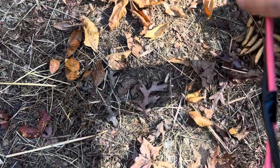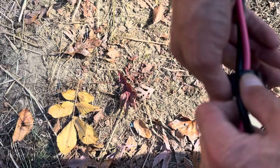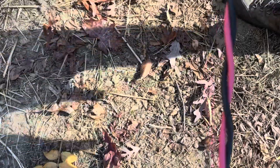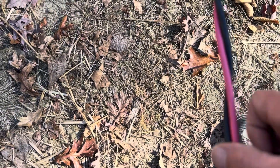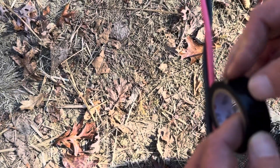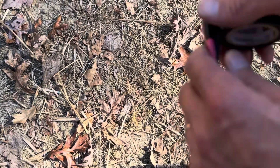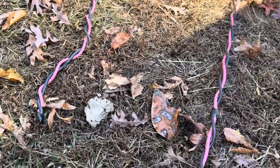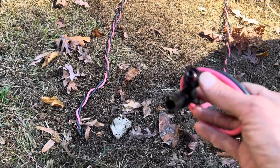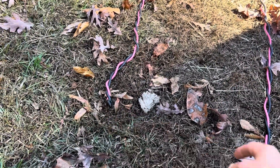That won't come unraveled or untwist any further. That will help you move the wire, run the wire, and keep them from getting snagged on stuff. You can use zip ties, electrical tape, or flex loom — you're just holding it together to make it easier on yourself when routing your wires. You've got about 50 more feet of this to do, but you get the idea — just tape it up and that'll keep it all held together. It's all twisted and taped up now. I've got it loose at my tie point — you can use the bumper of your truck, your trailer hitch, what have you. There's the end that's going to be on the roof — I'm going to run that end down through that chase I showed you a minute ago.